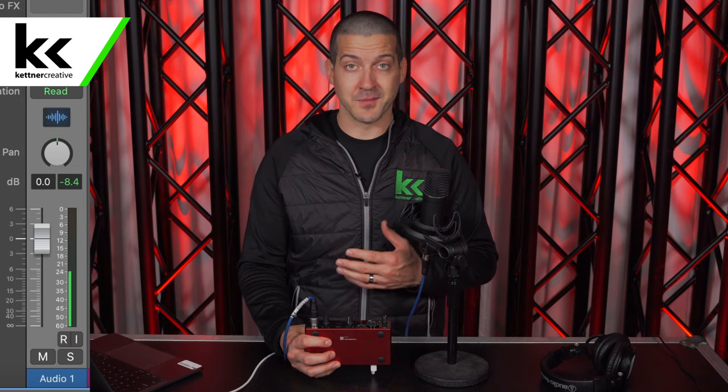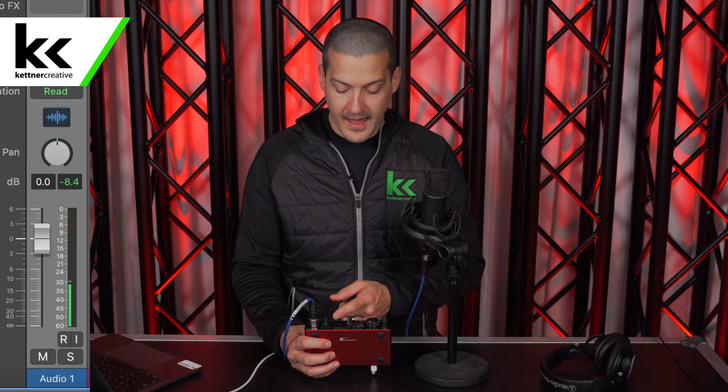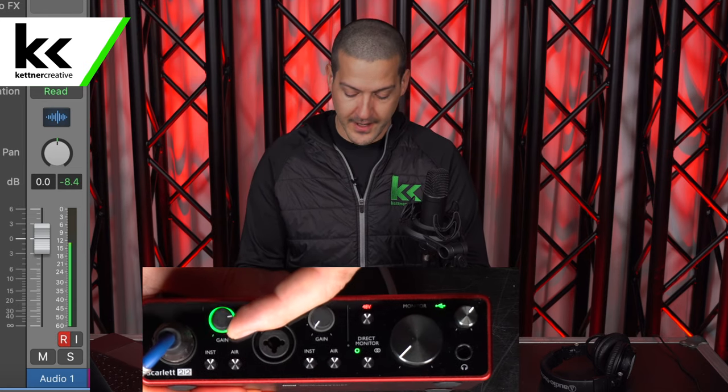If you're recording a podcast, you're going to be dynamic — happy, sad, with a whole range of dynamics, loud and quiet. You want to make sure you're never peaking the microphone; you can always adjust levels later, compress it, do whatever you want after the fact. But make sure none of the raw audio is clipping. As we turn the gain up on this preamp, we'll notice the ring goes yellow.